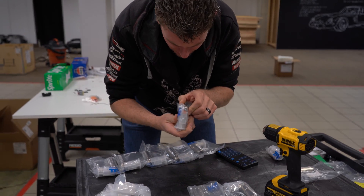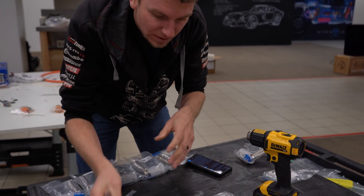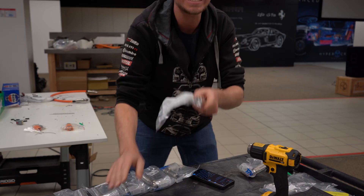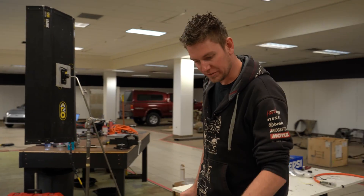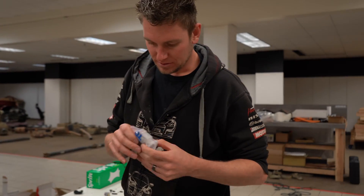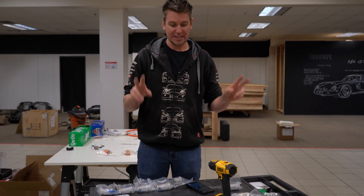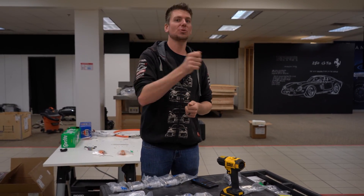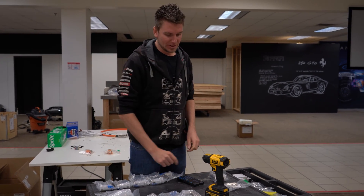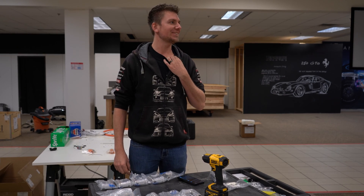Do you want to explain to the people who don't know what the Y, V, W, X, and Z connectors are? When I'm talking about like we have a V key, we say this one is a W supply - these are X because these are the same connectors but they're keyed. You can't plug an X into a Y, it just won't plug in. It's basically indicating and separating - it's making it safe so you can't screw it up.